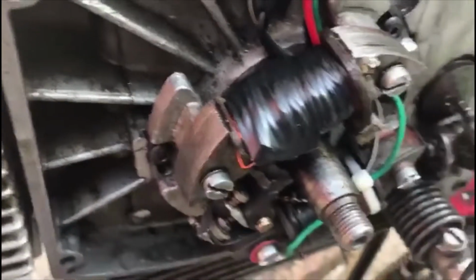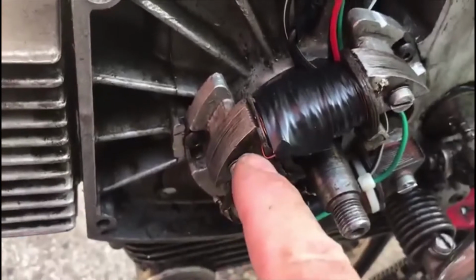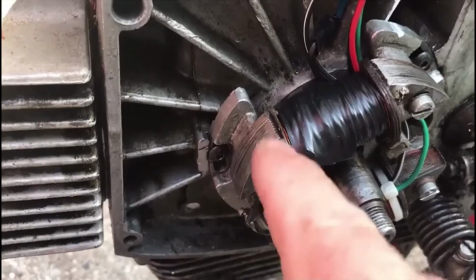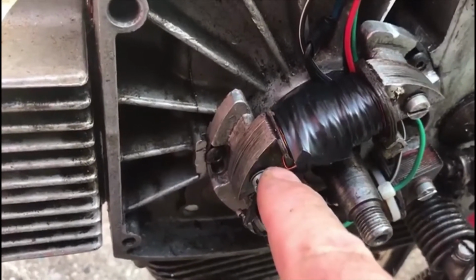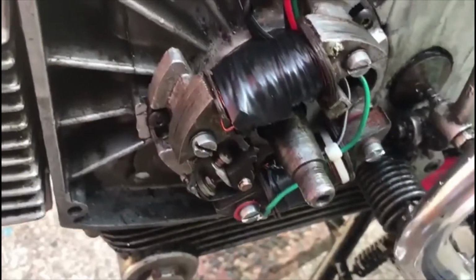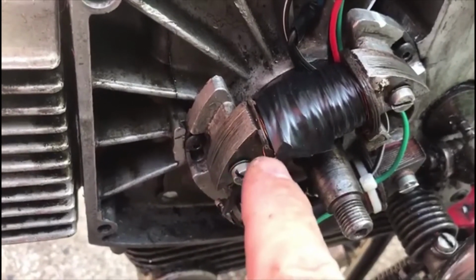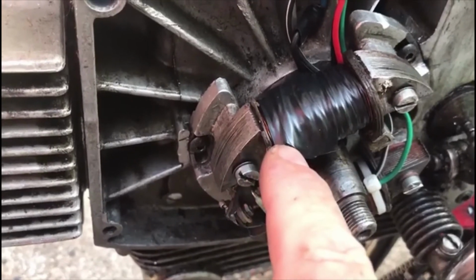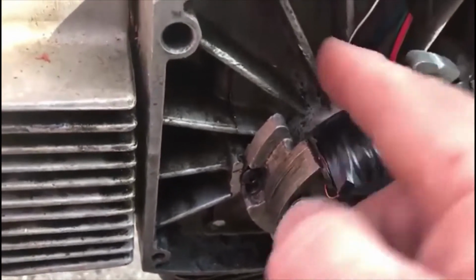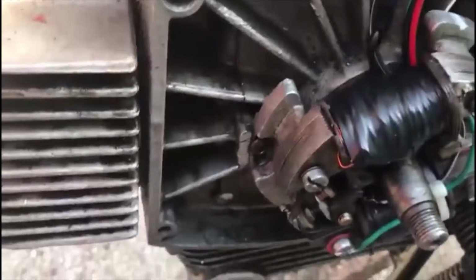Now, to say I'm annoyed is an understatement, because these two wires that come out here, this copper wire I've wound it with, it's not copper. It doesn't solder. I cleaned the ends off, and I was going to solder the wires direct on, or put a soldering connection on, and it won't take solder. I think it's aluminium wire. I've come across it before. This won't take solder. I've cleaned all this varnish off, tried it loads of times, and it will not take solder. So what I've had to do is crimp a connection on and then solder my wire to the crimp. It's a little bit bulky there, you see it sticking out, and I wanted to avoid that, but I'm annoyed because it doesn't say copper on the spool, and I assumed it was copper. So there you go, you assume things and it's not right.